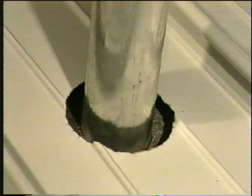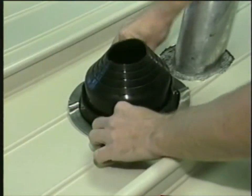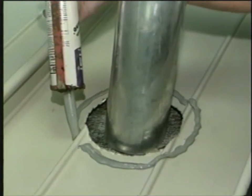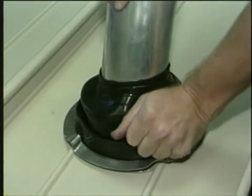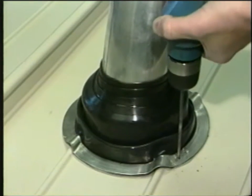After the pipe is installed, cut the top of the boot if required to fit snug. Field form the boot flange to fit around the pencil ribs. Apply a continuous bead of sealant caulk and place the boot over the pipe. Rivet to the panel on each side of the pencil ribs and 3 inches on center max.